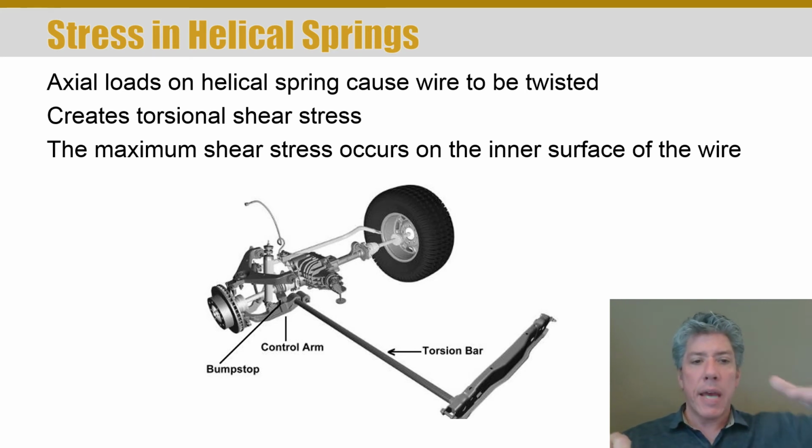And what would happen is the A-arm that you see supporting the wheel, there was pre-tension in the rod, and so the A-arm was trying to go down to support the weight of the vehicle, but the weight of the vehicle caused some twisting in that torsion bar. Now the end that was on the frame of the truck, the end you see here connected to that cross member, had to be held very well, and so I was concerned that if this thing rusted out, it would let go of my springs, and basically the front end of my truck would be squatting. I guess then I'd have a lowrider, but the truck really didn't look like something that should be a lowrider. It was just a conservative truck, so it looked funny.